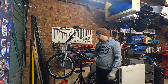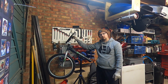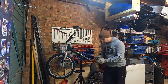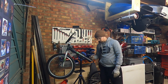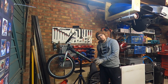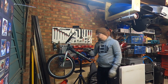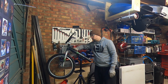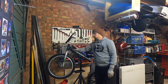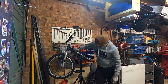The BMX frame no longer really looks like a BMX anymore - there's not much left to it, and that is exactly what you need for the drift trike. Just a few key pointers: once you've cut off the chainstay and seat post, just go over that with a grinder, get all that smooth, because you're going to be welding some bar on there later on so you need that to be fairly smooth and fairly clean. Also, what I'm going to do - I've tried cutting the top bar to match the angle of the down tube. That will look cool because once I'm done, I'm going to weld a plate over that hole and that should all seam into one.